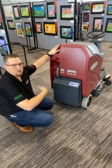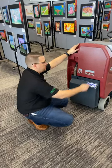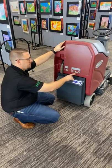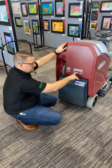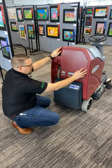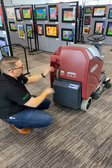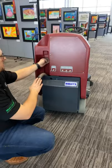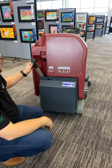Now if you happen to pick up something very large and the brushes stop on it, your circuit breakers are right back here. This one is for the side broom, this one is for the vacuum motor, this one is for your main brushes, and then this is your panel or display. All your electrical is located in the back of the panel right here to get to any boards or anything there. This is a vacuum inlet right here so you can catch the suction coming out of the machine, and then this would drop down and hook up to that back brush for the vacuumized sweeper.